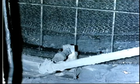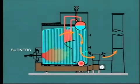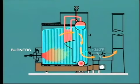The area where this is most likely to occur is in the air heater. Remember that the incoming air is entering from atmosphere, and this may be at a temperature of, say, 60 degrees. Consequently, the temperature of the metallic element of the air heater in contact with the incoming air will also be quite low. In order to avoid air heater corrosion, we need to make sure that the temperature of the combustion gas leaving the air heater is above about 350 degrees Fahrenheit.